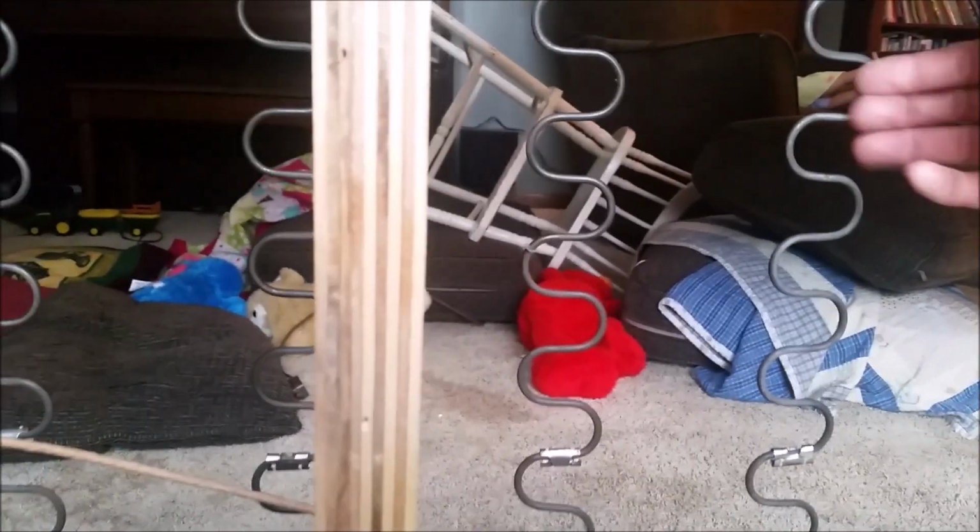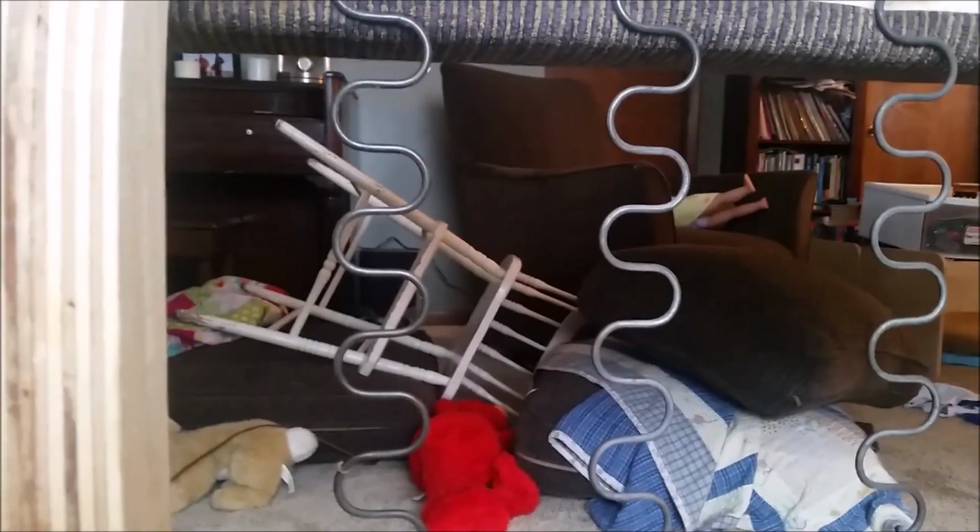So this little connector holds the twine. Now you can open that up and you can reclose it with pliers, but I actually only had one strand across this entire couch, and I am adding a second one. If I'd have been thinking, I might have even done a third, but it's not really adding support, it's just tying the springs together. So I'm adding a whole second row, and it was cheaper for me to order a package of 50 than to get enough to go all the way across the sofa plus the chair that I'm doing.